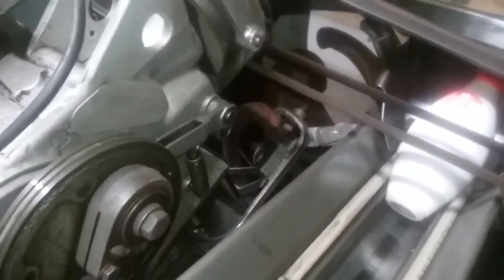This is the deck; these are all your chutes — it's in a weird position. Here's the gearbox and the motor. I think he said it was about one horsepower. It spins into the gearbox, and the gearbox spins the ball wheel, the pinwheel, and the shakeboard down there. It also converts this motion into sideways spinning — inside there are a bunch of gears that spin this piece sideways. When these go sideways, this piece down here pushes out, latches onto that piece, which is connected down to the rake, and it sweeps back and takes the pins off.